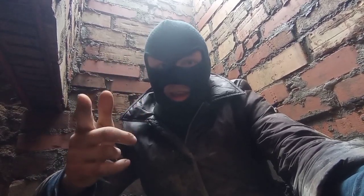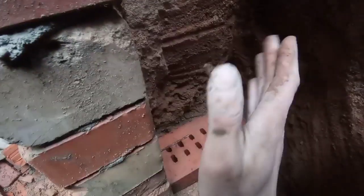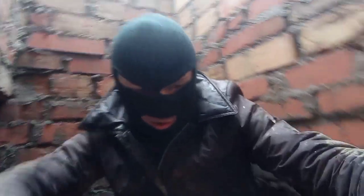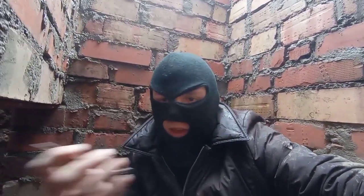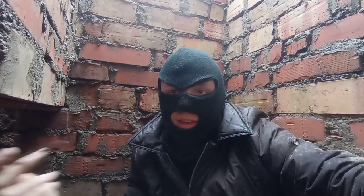This is an oversight that I did, but how I'm going to fix that mistake is very easy. There's this doorway pretty much, and I was going to build a tunnel anyway in this direction, so what I'm going to do is take some bricks. This is going to be the wall of the tunnel going forwards, and what I did is I took a six-millimeter concrete drill bit and drilled holes inside the pillar. I'm going to put these tiny pieces of rebar here, and what these tiny pieces of rebar are going to do is connect this pillar with the wall. Hopefully, if this pillar does decide to buckle out, those pieces of rebar are going to pull along the tunnel wall and hopefully prevent the whole tunnel from collapsing. That's pretty much what I'm going to do.